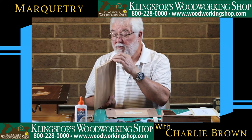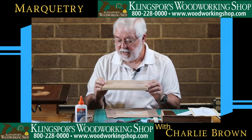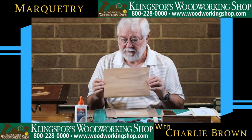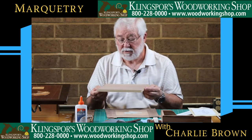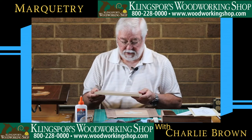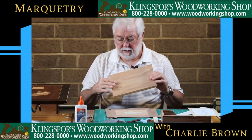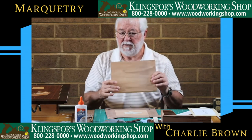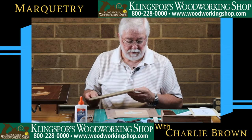medium density fiberboard, I think is what it's called. This particular one has veneer on both sides, and you can get that at a few places, but not everywhere. But most large sheet goods stores, you can get that, or some of them you can. You can get MDF almost anywhere. I would recommend to you that you veneer the back side of it, because you want to do the same thing to one side that you do the other. So if you're veneering one side, you want to put veneer on the back side. That contributes to stability. So I would recommend that to you.